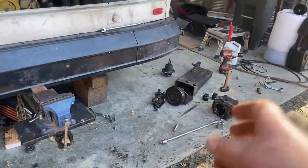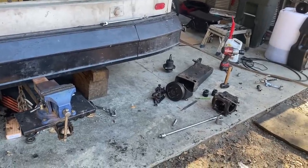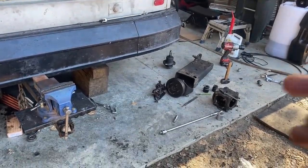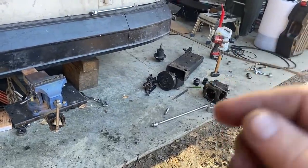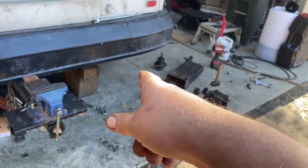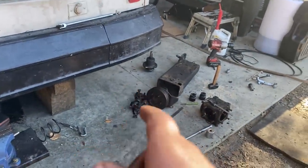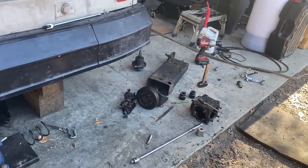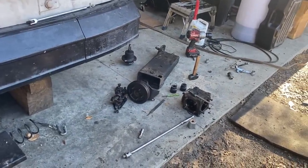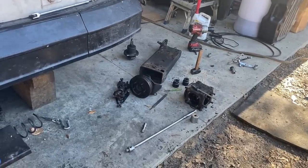Well, our buddy Jeff came and picked up the new hub and the parts. He's going to machine them for us. So he's going to make the mount for the fan. He's going to re-drill that and get that right and take off that little lip on it. And then the yoke attachment there, he's going to take that and increase the taper on it to fit the shaft and enlarge the keyway. So I don't think it's a big deal. He should have it done tomorrow for us. So that's a nice quick turnaround time. So everything's working out, moving forward.